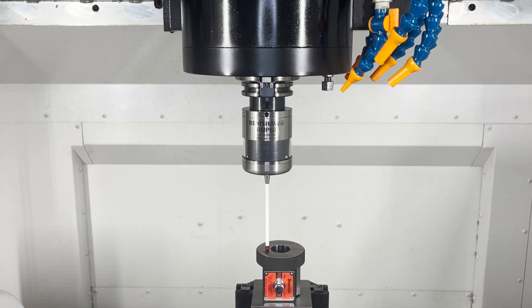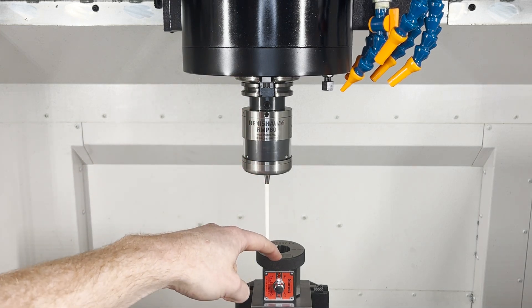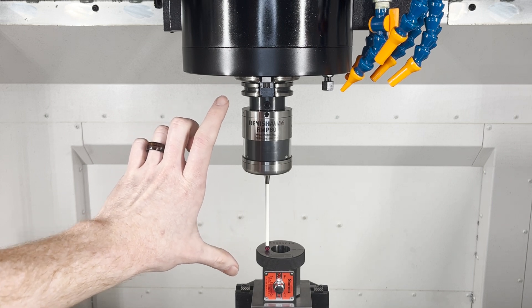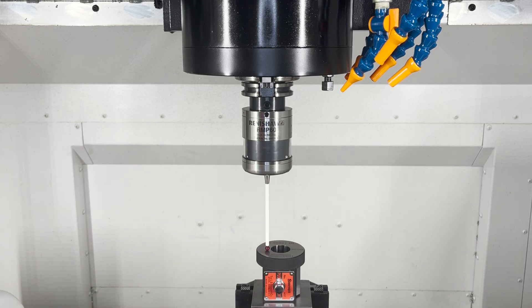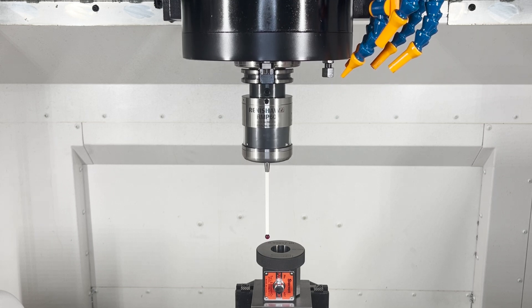Once you've done that, the reason it does that calculation for you is because it knows where the spindle nose is and the work offset that we now have active, which is the surface. We're telling it to calculate the distance between there by saying CAL, zero — how far away am I from my current work offset Z-zero? Now that you have that, go ahead and hand wheel your probe up off of the surface of your ring gauge. Once it's off, go ahead and hit reset, and we can move on to the next step of our Z-axis calibration.